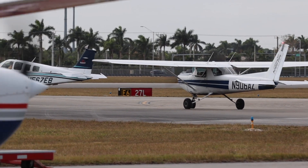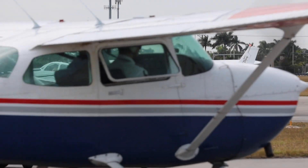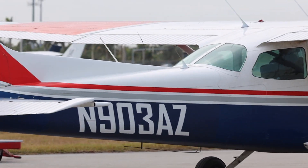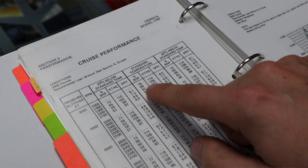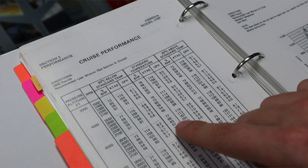Let's look at what leaning really is. Proper leaning procedures produce optimal engine performance. Leaning before you taxi prevents the spark plugs from fouling with lead deposits. Most importantly, a properly leaned engine will yield higher performance, longer range, and endurance figures found in the pilot's operating handbook. If you plan a flight based on those figures and you don't lean the mixture, you could run out of fuel.